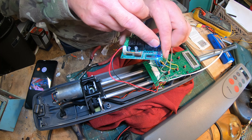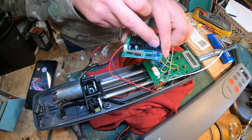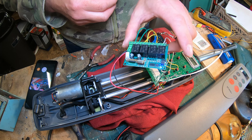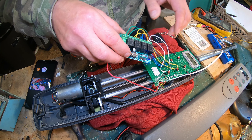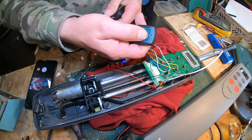If you connect the two right ones, you get a permanent connection — so you press the remote and it stays connected until you press something else. If you take the jumper off, then you get what we want, which is like a single press key. So basically pressing the remote is exactly the same as pressing the switches on the unit. I now have full control over it.